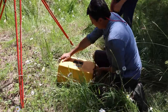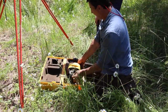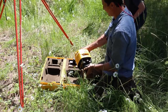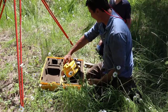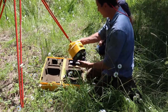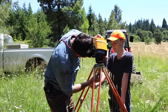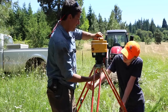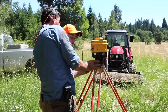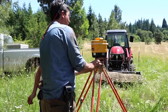This grade laser level doesn't probably look like much, but when I was a young man and had to buy this thing it was around three thousand to thirty-five hundred dollars — that really meant something. I was just getting started in my excavating business with huge equipment payments. It was the hardest thing I ever had to buy. There's a tripod stud so you mount it and screw it on. To level it, there are three adjustment points — bring it down until the bubble is exactly centered. It will not spin if it's not level.